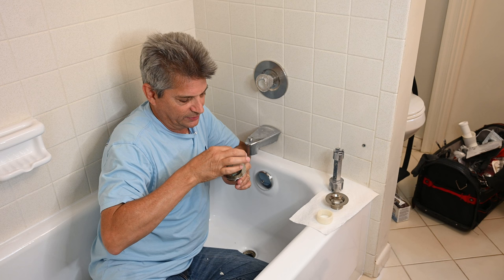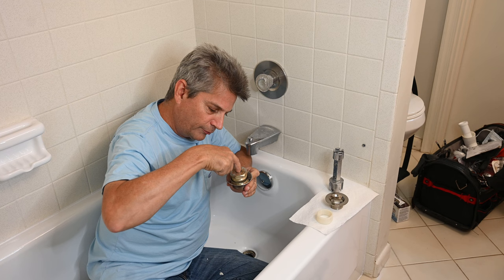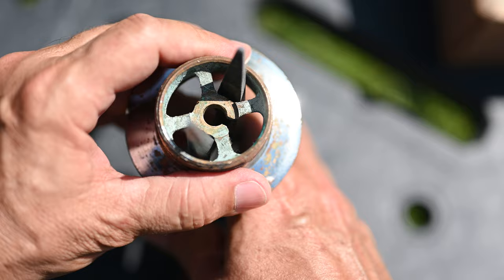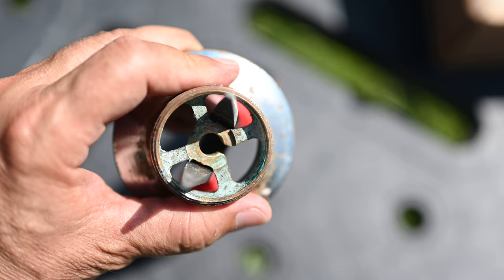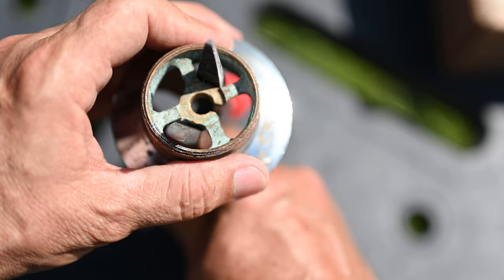The way the tub drain extractor works, it goes in the middle like that — though this one's too small; you'd need the next size up. It goes in, you pound it in place with a hammer, stick your ratchet in, and the ratchet helps loosen the drain. With needle nose pliers, instead of four perfectly shaped pushing surfaces, you only have two, and they're not perfectly shaped — it's a sharp edge going right into those walls. You're going to push that sharp edge into the spoke and it will shear right through, or you'll break your own needle nose pliers.